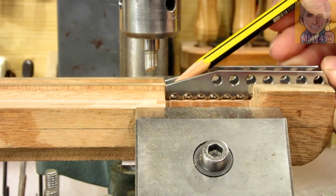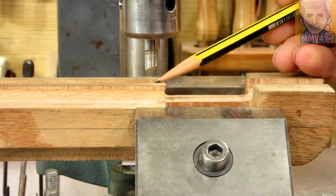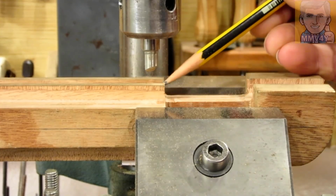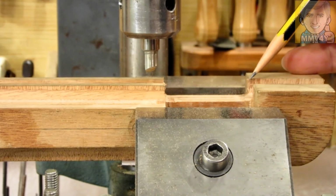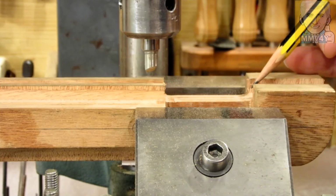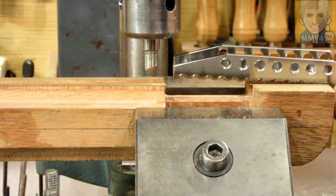I'm checking the depth, and it actually looks pretty good, because this bottom is sitting just a little bit below this groove for the spear shaft, which is good. Unfortunately, two corners chipped off, like this one here and this one here, so I have to glue this back or build up the corner with a mixture of epoxy and sawdust. So now the next step will be to drill the mounting holes for the Dyneema stop.